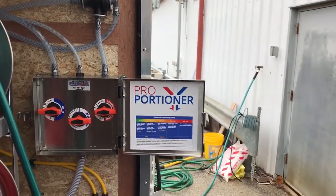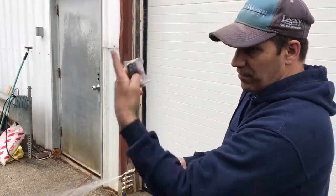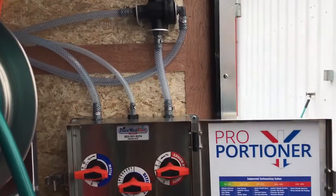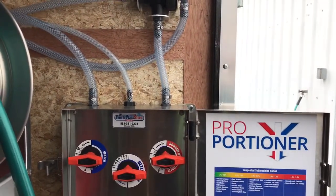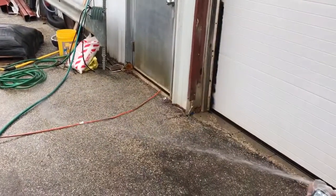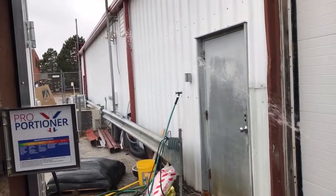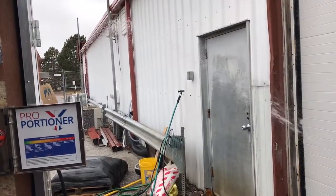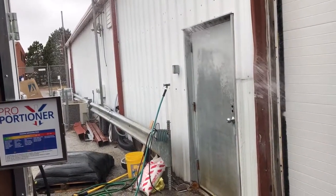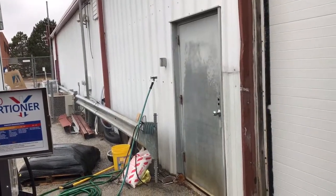I'm going to hit the A button again because I lose all my pressure after sucking a bunch of air in, so I'm going to force the air back out of the system. I'm going to hit it one more time to make sure I got all the air out on the water line, and you see another little air bubble come through there. Now you can see how the pressure just drops — I'm barely getting anything out of it. You can see from the distance we're shooting. Now if I hit it again, you'll see when I force feed it, it picks up and the distance goes a lot farther. I've got a smaller nozzle, so it's atomizing it a little bit, but there's a lot more pressure and flow.